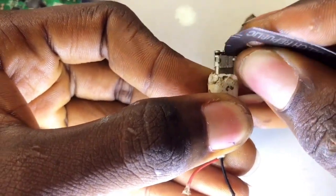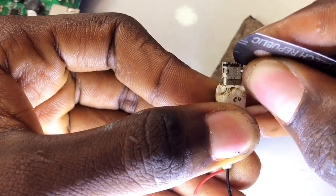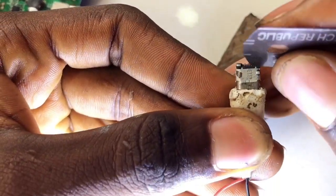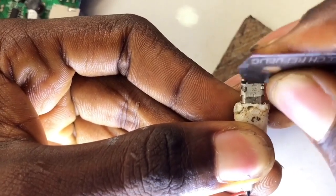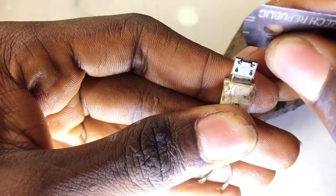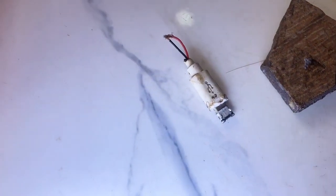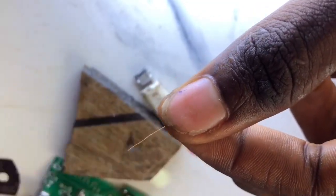Now that we've identified the negative terminal, the other terminal is the positive - the one that pulled from the port. I need to pull out the remaining three terminals in the middle of the charging port, as those terminals are not necessary when performing a jumper on an MP3 board. Once removed, use a razor blade to scrape out the positive and negative terminal areas so the soldering lead will properly stick to those two terminals.